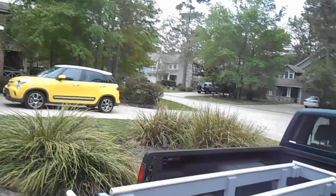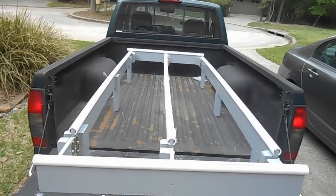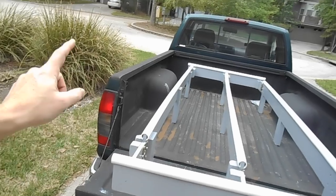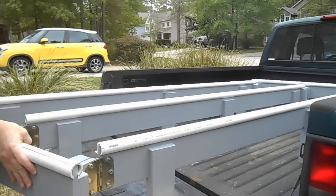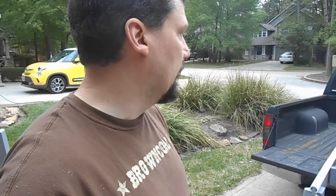So that's it — the second hauling rack for my pickup truck is done, and this is very very strong. Pretty much you can load this up to the capacity of your truck, which you do have to be careful of particularly because you're going to be supporting a fair bit of weight out here on the tailgate itself — so bear that in mind. I would certainly not on my little truck haul more than maybe three or four sheets of MDF at most because I don't want to risk overloading it. Let me show you how it folds up and stores away like a ladder hook rack — just pivots together along the hinge lines. It's still pretty stable. Well worth it, and in my case other than the PVC pipe, everything was scrounged so I'm out a grand total of ten bucks and I now have a way to haul sheet goods and load them and unload them much more easily.